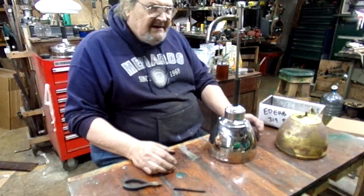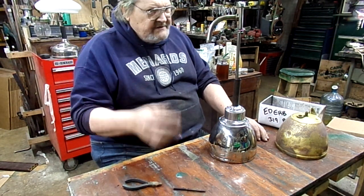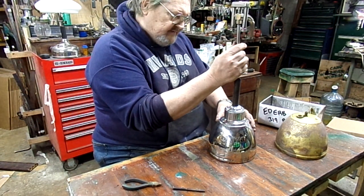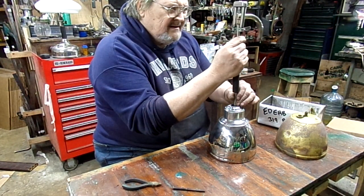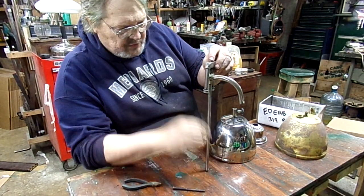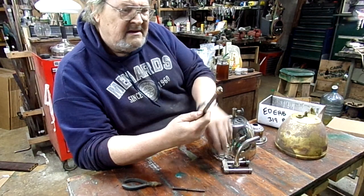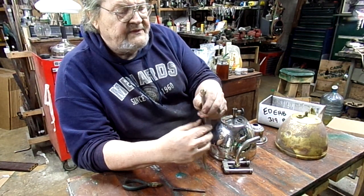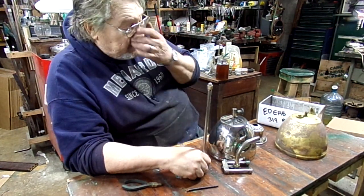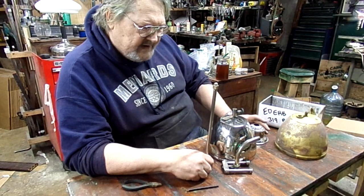But before they came up with this, this is what they used on the Model A reading lamp. When I first got it I thought, where the heck is a generator on this thing? The first time I saw a picture of one, and when I got one in hand, I was able to figure it out. I haven't tightened everything up — I kept it loose so I could show you what's going on. This up rod is not only the support for the burners, it's also the generator. The massive nut is the orifice — there's a little tiny hole. This is what they started out with, and I always wondered once I started looking at it, how in the heck can you have this much raw fuel so close to the flame and be safe?